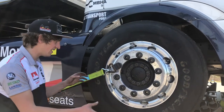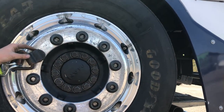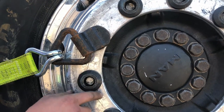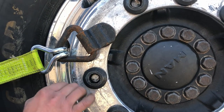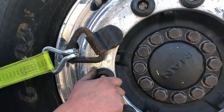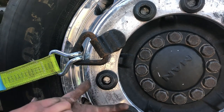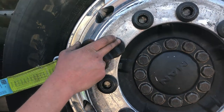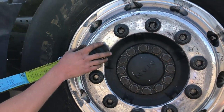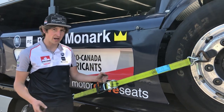The actual lashing points are old front wheel nuts, and when we're racing these are like the sacrificial part of the race truck. It's quite often that they get damaged or too badly damaged to use — either for the allen key socket or they can cut your hand quite badly. We actually save them, then we just skim the top off on the lathe and weld a lashing point on.